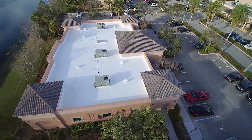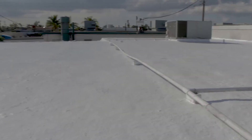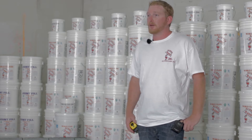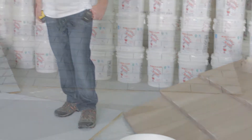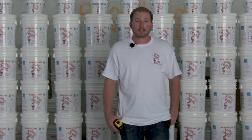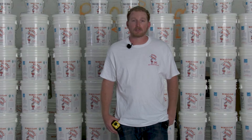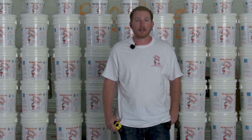When kept clean, it's guaranteed not to go above 105 degrees Fahrenheit, and typically you would clean it every five years when it's time to do a re-coat. R400 rubber can be used as a re-roof alternative on many different types of roof coverings such as a tile roof, a modified bitumen or flat roof covering, or a shingle roof. R400 rubber is an extremely energy efficient product — it is FP&L approved and is also an ENERGY STAR rated product. If you have any questions regarding the energy ratings, feel free to contact us here at All White Manufacturing and we'll be happy to answer them.